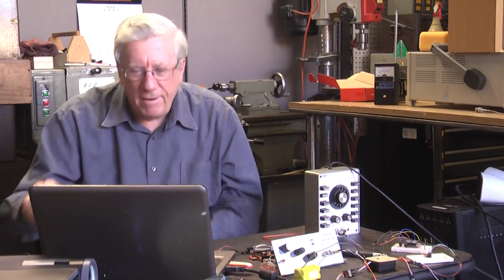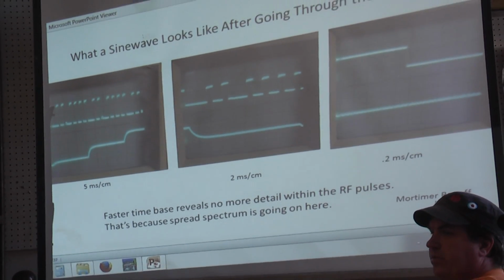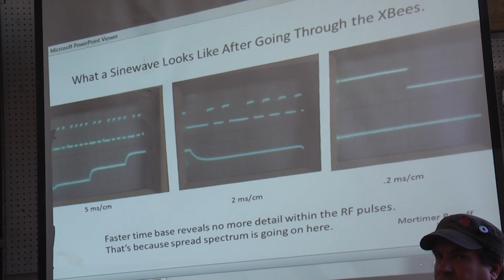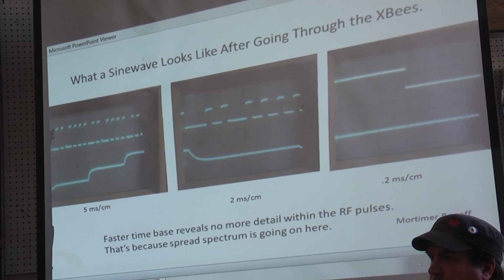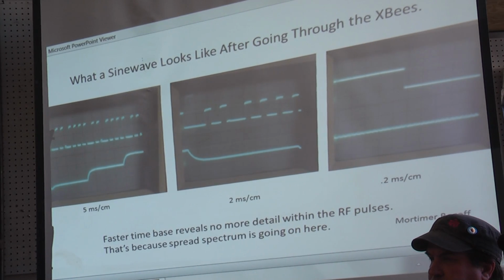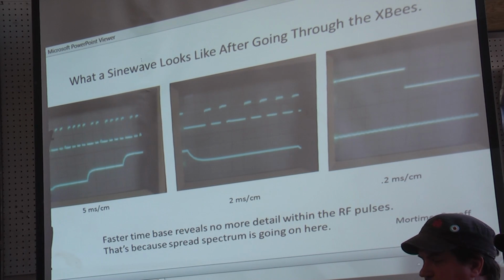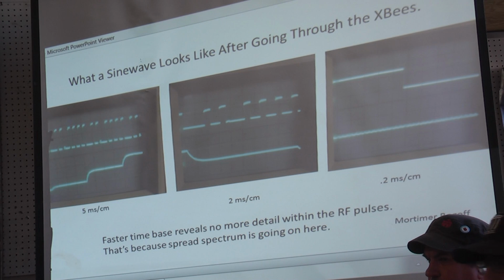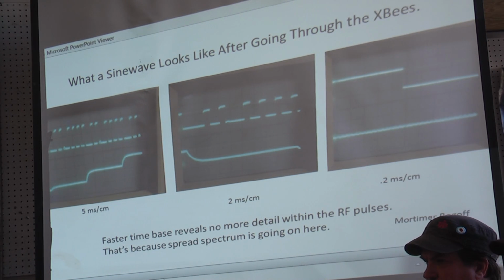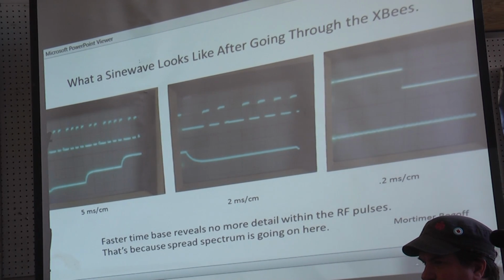explore a little bit and in depth, and that is the fact that somewhere in those pulses is the information. It can't be the separation, because no matter what you do in the way of input, the pulse widths stay the same, the separation, the height, everything's the same. It has to be, and by the way, there's a header that's huge, like 64 bytes of header, and then there's the, what's it called, the correct sum that goes back the other way. Checksum, thank you.